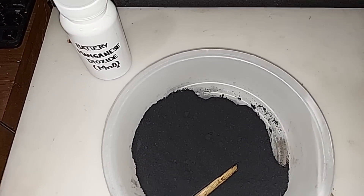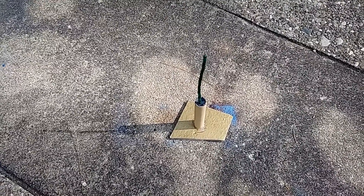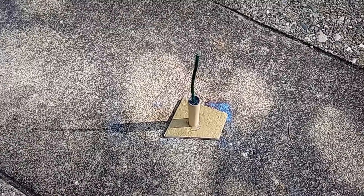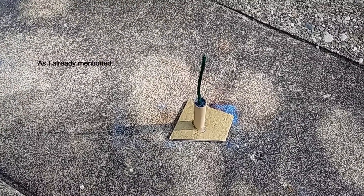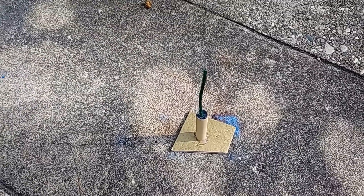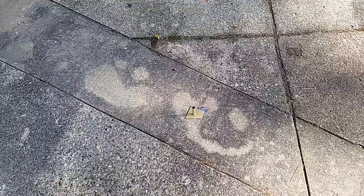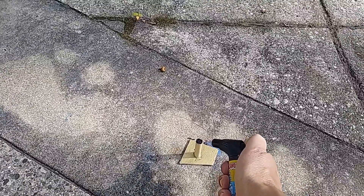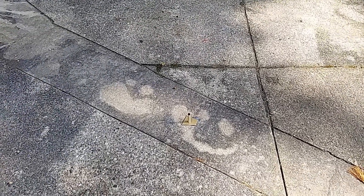It's all dried nicely. This is my very first test: 17 grams total — 12 grams were manganese dioxide evenly split as 6 grams pure and 6 grams battery MnO₂ — plus 5 grams of aluminum. Let's try it out. Since it didn't light the right way at first, I got it going and — interesting — it doesn't want to burn continuously through. I've got to refigure this.